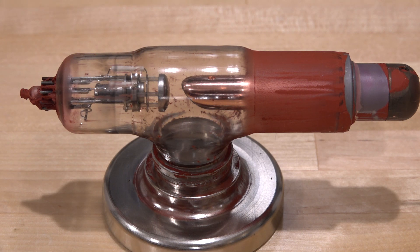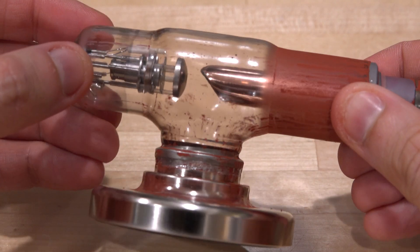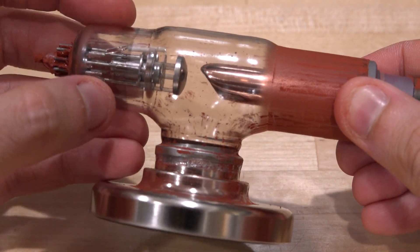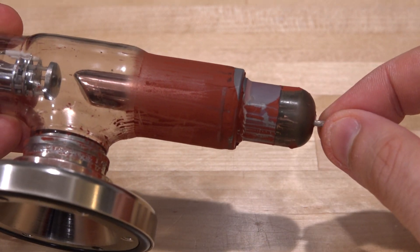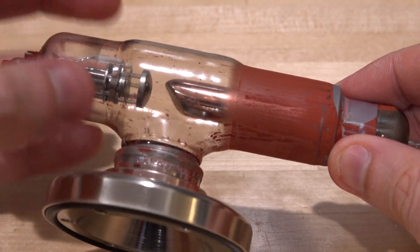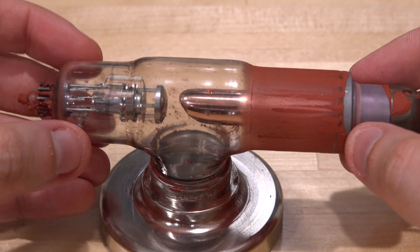Now, the way this operates I described in a previous video, but now we can see the internal construction. It really is not magic — we're creating electrons, accelerating them, and colliding them with a surface to create x-ray. On the left side, the heating element is probably inside of that cylinder. That's going to cause the temperature to rise and we're going to get thermionic emissions — electrons leaving that and being accelerated toward the other plate. The high voltage input is connected over here, so this thing is sitting at a positive voltage, and a very strong electric field between this side and this side of the tube causes the electrons to accelerate — the cathode and the anode, of course.